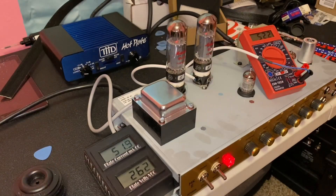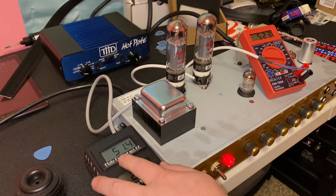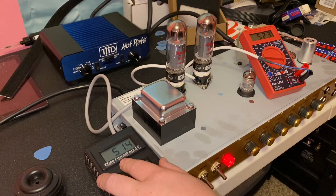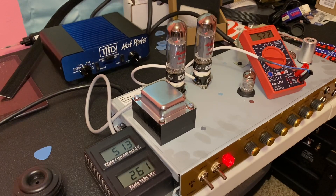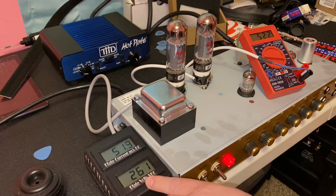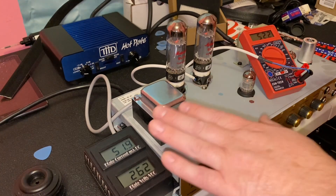And we're back. The amp has pretty much stabilized. When you look at this sensor here, it's showing that the plate voltage coming into these tubes is around 260 volts DC — 262 roughly. The plate current is showing 51.4 milliamps. On a standard amp, which would normally have like about 450 to 460 volts — like the Marshall JCM 2000 that I have — the calculations are quite a bit different.